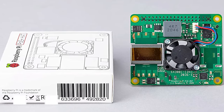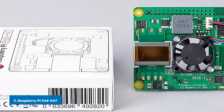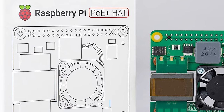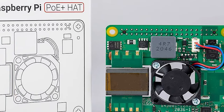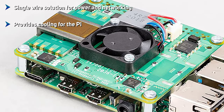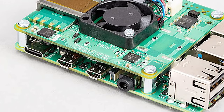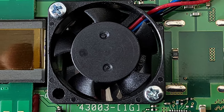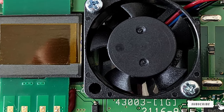Moving on to number seven: the Raspberry Pi PoE Hat. The Raspberry Pi Power over Ethernet hat is compatible only with the Pi 3B+ and Pi 4, and provides a single-wire solution for network-powering your project. This hat is extremely useful for installing projects in remote locations such as in your garden or a shopping mall. Using this hat also provides a cooling fan, useful for the Raspberry Pi in general as it keeps the temperature down — more so since the release of the Raspberry Pi 4. The PoE hat fits atop all of the GPIO pins but an included extension header means we can connect another board on top, provided there is clearance for the fan.